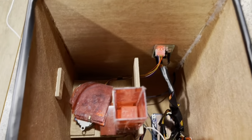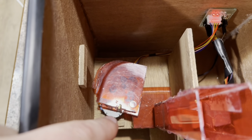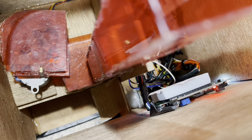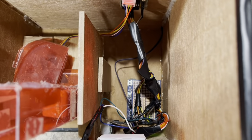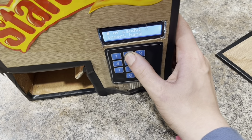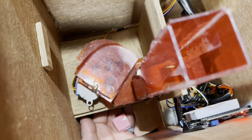To show you what's going on inside: right here you can see I've got a stepper motor. When it's activated by the motion sensor it'll push the candies out. Down in there I've got the PIR motion sensor that'll detect your hand whenever you put it in. And there's the Arduino down there. Here you can see the display as well as the keypad. Depending on the number you put in, as soon as you put your hand in there it'll activate the stepper motor to push the candies out.